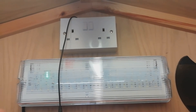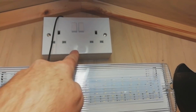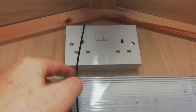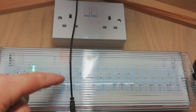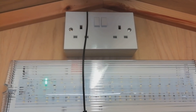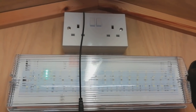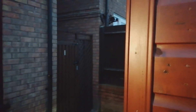Here's what it looks like in my workshop. I've got a double socket here — I'm going to label it 'lighting circuit only,' because it's always worthwhile putting a label up to remind me. That's the USB cable — a short one — drilled through behind the socket and out. It's wired into a simple terminal block at the back, goes through the wood and out. If you don't know how to wire mains, please don't do it — it's not something to experiment with. I don't want anyone getting electrocuted. Next stop: showing you the finished product outside.